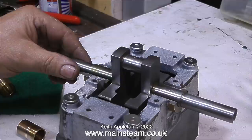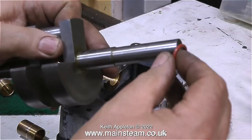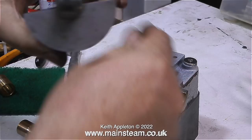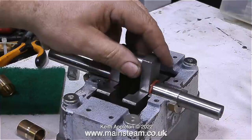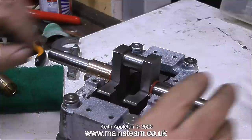The other thing I'm not happy about is the amount of side play on the crankshaft. This side play is controlled to a certain extent by the position of the big end brasses between the crank webs, which are fastened to the connecting rod and crosshead so they can't move very far. A quick fix is to fit a silicone or Viton o-ring onto the crankshaft between the crank webs and the bearings. I've used this trick several times on smaller steam engines — it stops the side-to-side play and the tapping that you get as the crank web taps against the bearing.